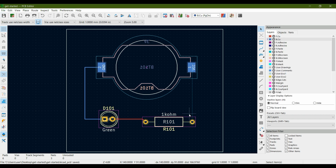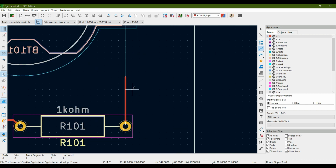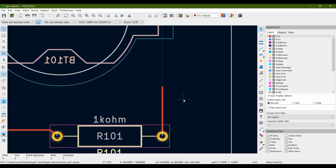And the other way you want to connect is you can use vias. Vias are basically through holes that connect throughout the PCB. We will discuss different types of vias later, but currently, let's say I draw a short length of track on the front copper. I choose the front copper and leave it over here, and hit escape. This is the track we have drawn on the front copper, and let me add a via on it. So this is add freestanding via.